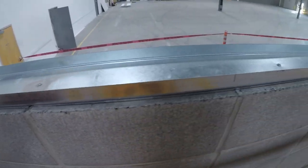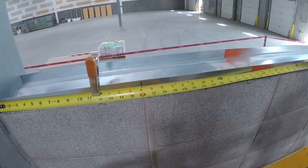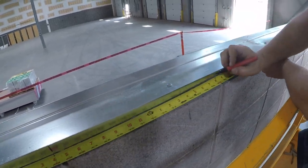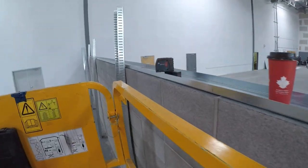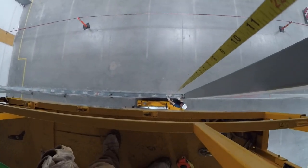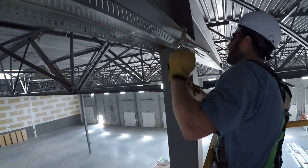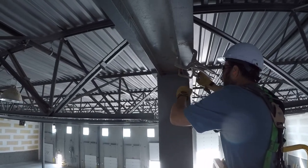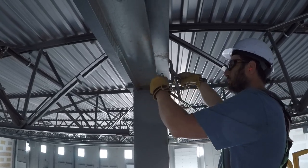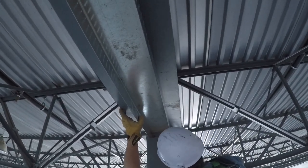Every 16 inches on this wall. There are three bays on this wall in total, so I basically treat each one as its own wall — go 16 inches off the beam. If you're lucky, the beam is level and you can put your sheets right on it. You need to stagger your joints on either end of this wall. Two pin lasers — those 100-meter tapes are the best for doing high walls. You get quick, accurate numbers. You just need a guy at the bottom holding it on center. I check the end of every 10-foot section I put on, check the height, and write down the measurement.